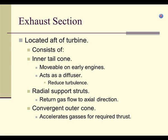What you had to do was put the tail cone on, run the engine, get performance numbers, then take the tail cone off and physically cut material off to open up the nozzle — you would trim it. That's where the term engine trimming comes from. In automotive you tune an engine; in turbine engines, you always say you're going to trim the engine. Trimming is performance monitoring and adjusting, derived from the act of physically removing metal from the exhaust cone to change performance.